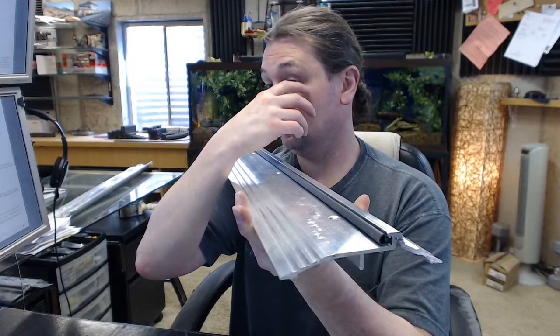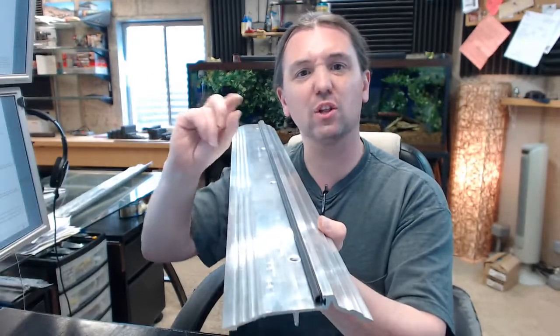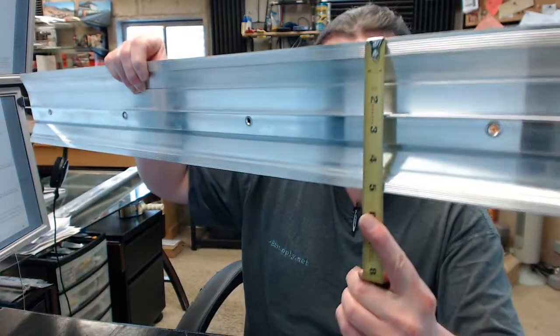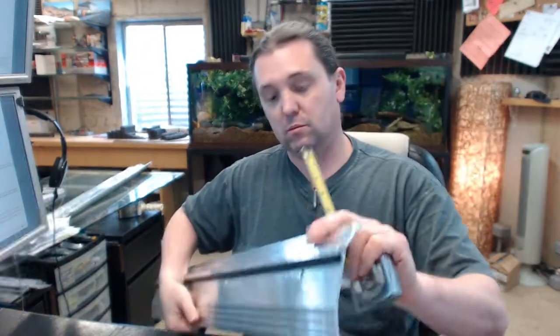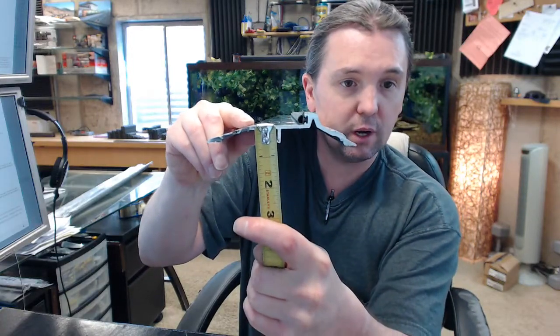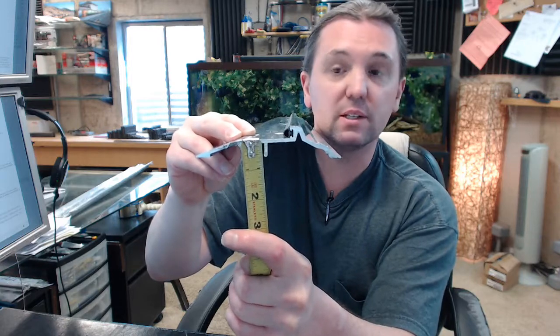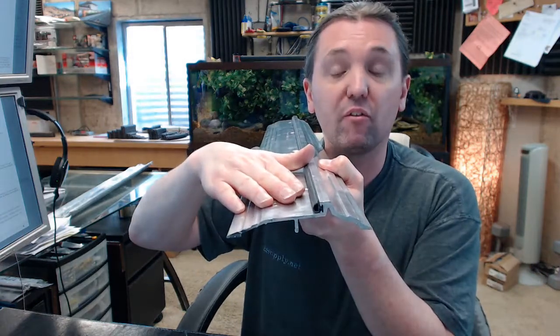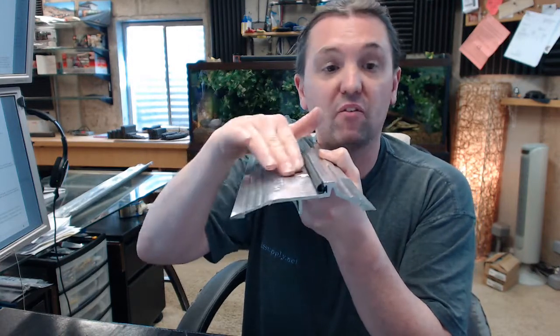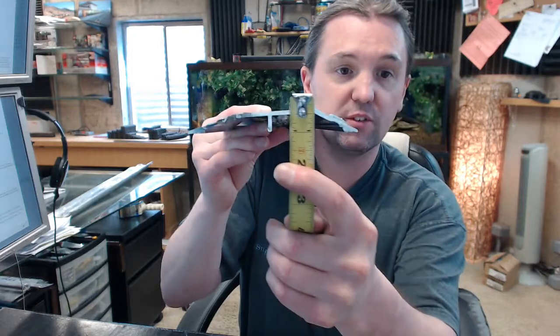This is probably, in my experience, the one model of this one notch less common, and that is a result of the dimensional properties of this item. And here's what I mean. It is 5-inch wide, and that is very common for a bump-up style threshold. What makes it a little bit less common is the 5/8 height. Generally, in a bump-up style, 5/8 might just be perfect for you, as you know. Also, generally in a bump-up style, we'll see like a 1/2 inch height, only because if you've got a typical hollow metal frame with a 3/4 inch undercut, perhaps having a 5/8 threshold height might be a little bit too close or too tight, possibly. It's got a 1 inch overall height, and that is certainly very common.